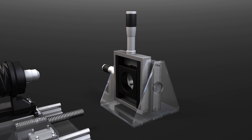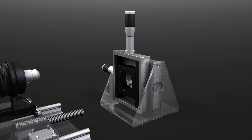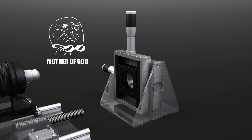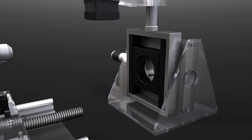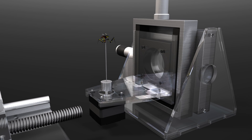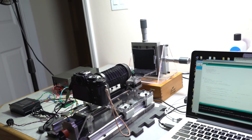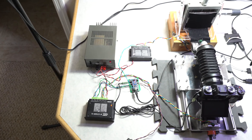To make positioning our subject easier, we're using a little XY table that I originally used for focus. That needed a little stage to mount the bug on, which is where we went off the rails. Rather than moving to the side for each new set of images, we added a second stepper motor for rotation — in other words, a micro-sized 360-degree Lazy Susan for 360-degree images. Awful handy having a laser cutter and a lab full of derelict projects to pull from. Finished rig? Not too shabby if I do say so myself.